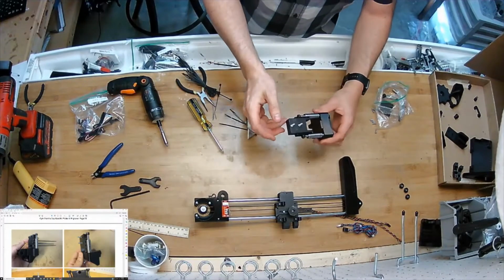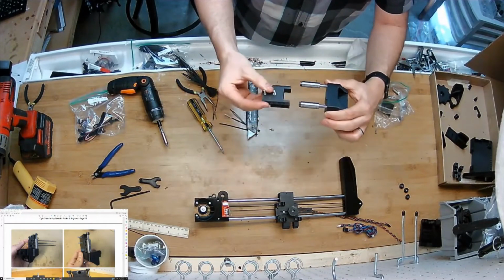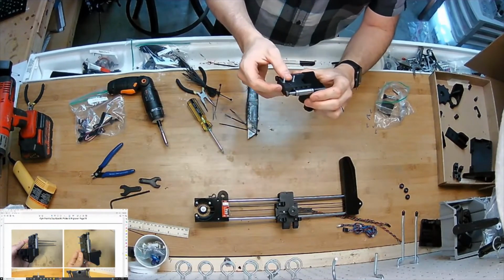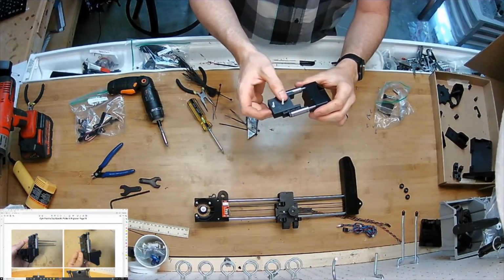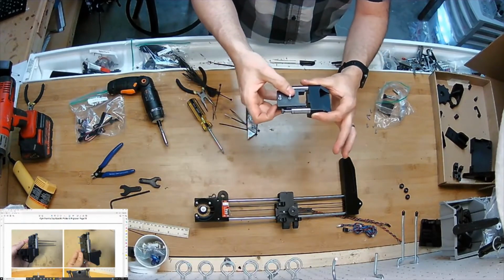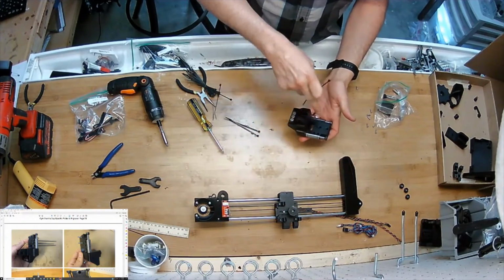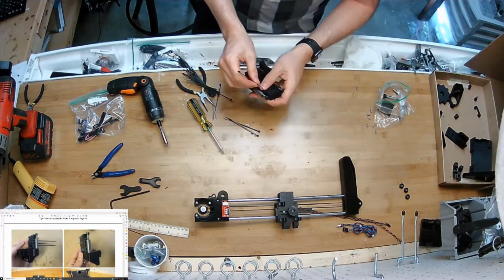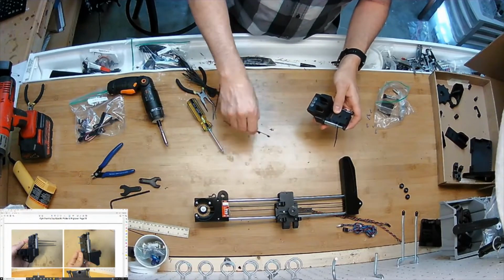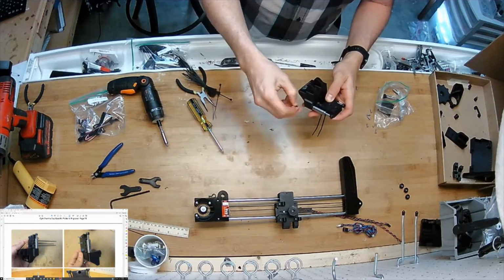Okay, I just paused it and gave this thing a blast with the heat gun for about 3 seconds on each side on their trough, and then I pushed it in like that. That is not something you should have to do with a kit that you buy from me. If you make it yourself, yeah, that's reasonable to expect you to do. This is the intended fit right now. It's just like very freely fitting in there. And what we're going to do with the zip ties, I'm going to take 3 and pick either side. It doesn't matter. I'm going to insert from the back, just like this, all 3, and then I'm going to tighten them as hard as I can, all 3 of these.